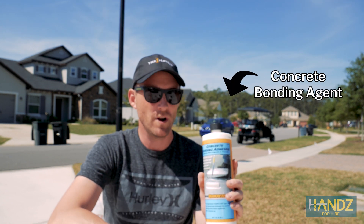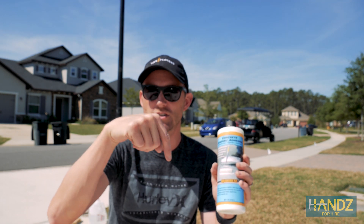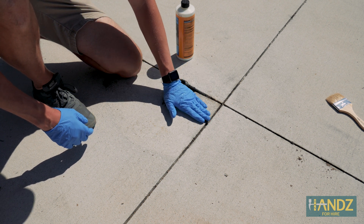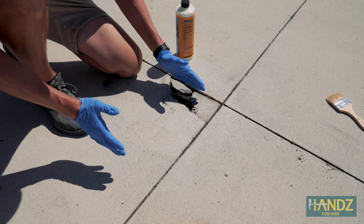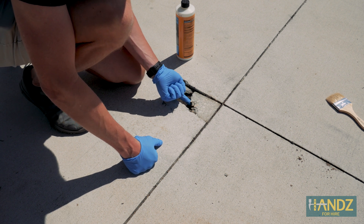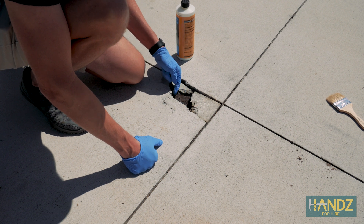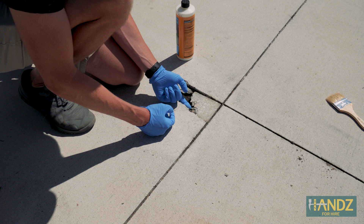You want to make sure the bonding agent goes on at least as thick as a coat of paint on a wall. I'm going to link all these products below in the description. This side right here is going to act as my leveling barrier, so when we pour the concrete in, it'll level out up to here. Then I'll carve out these little grooves so the concrete can expand and contract over time. Under here I've got a little cavern. If you're able to chisel so that the concrete goes a little underneath the lip, it'll make a really tight bond — if it tries to pull up, these other pieces will stop it.